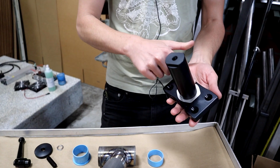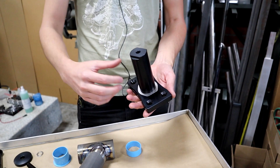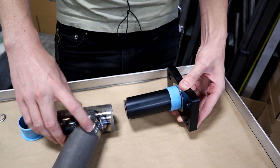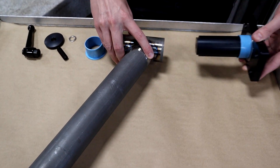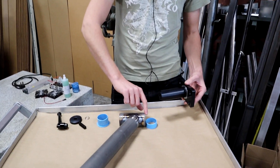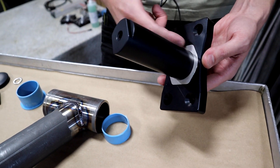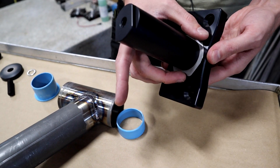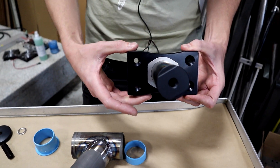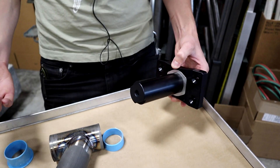Coming out of this, we have a stainless steel laser-cut plate — I call this the watch plate because it reminds me a little bit of a wristwatch. It's a shape that keys into this piece of aluminum, which becomes relevant in assembly. I slide this sleeve bearing over and it goes inside of this other tube and gets pressed in — really nice fit, even after welding. The steel face of this tube bears directly against this stainless steel washer. If this ever were to wear out, you could replace it. You could also replace it for a different material — but I think aluminum and stainless steel is probably what we'll stick with, since aluminum is very manufacturable and the stainless has good wear characteristics.